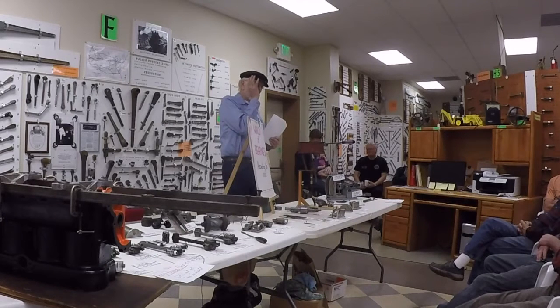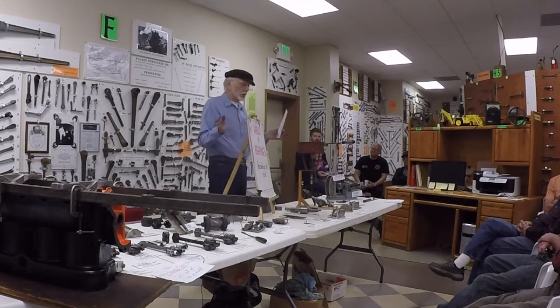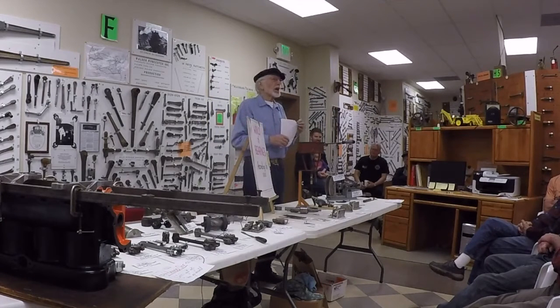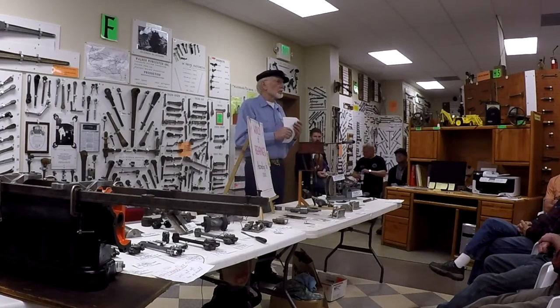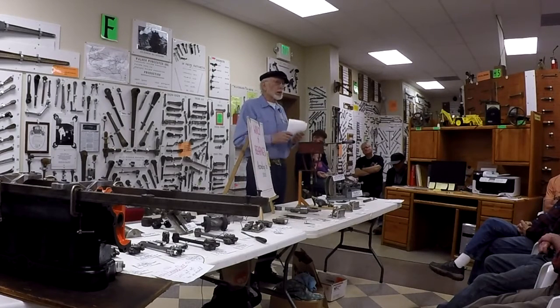And a guy that I was talking to about this, he says, what I do is I take the Model A block or T block. I shouldn't do that. The guy means well. And he said, I put it in my wife's oven, and I turn it up as high as it'll go, and I leave it in there for X number of hours. And he said, it comes out of there about 400 degrees or better. And he said, I pour that Babbitt, and it goes down in there beautifully. And I said, well, how long does it take to cool off before you take the fixtures and stuff off? He said, it doesn't matter. I just leave it set there, maybe an hour and a half or so.